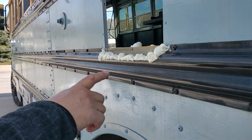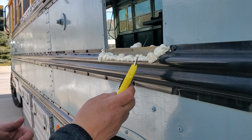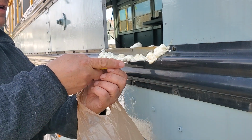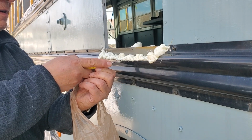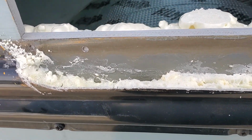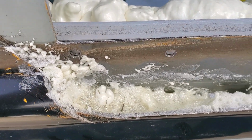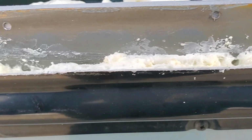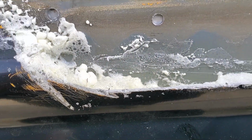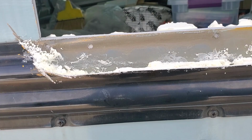It's a few hours later. The foam has dried. I'm going to trim it now using this long-bladed knife, which is also not a kid-friendly task, so I'm going to do this on my own. I felt compelled to use the whole can of foam at once because there's no practical way to clean the nozzle to use it at a later time. I think I ended up applying it too thickly because when I went to cut away the excess, it's still moist down there. It hasn't fully cured and doesn't have the nice smooth surface I was hoping for. I'll need to do something to remedy that.